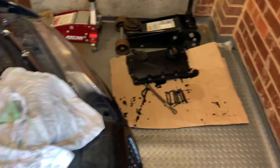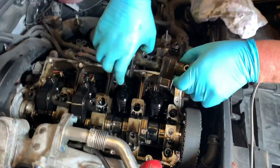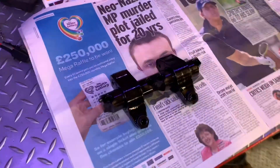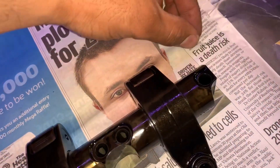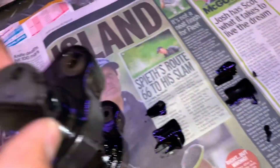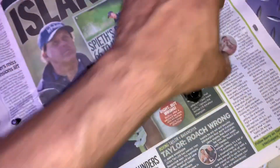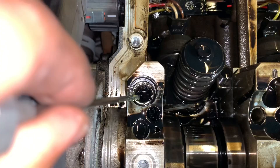We've removed the bolts that hold the injector rockers in and kept them in order. These rockers are now free to come out. This is the first rocker - you can see this lead plug has migrated axially, and on this side this lead plug is actually coming out. On the second rocker there's a lead plug which is intact, however on the other side it's absolutely missing. This may be because it's fallen inside the engine somewhere, or someone's had the rocker cover off. We've found the lead plug - it's actually just sitting in here. We're going to get that out and put it on the table.